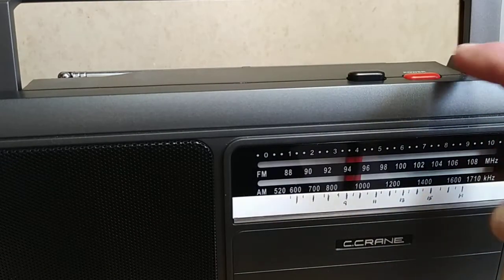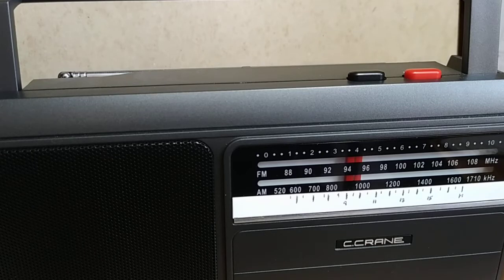That gives you a good starting point because the dial steps every 10 kHz when you turn it one notch. So you can whiz up — if you want to get to 1040, you go up to 1000 and then count as you turn the dial: 10, 20, 30, 40 — and you'll be spot on at 1040 kHz. That's definitely an essential thing to have on the radio.